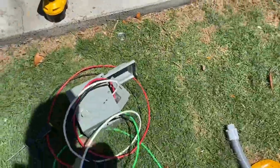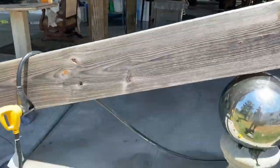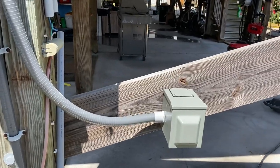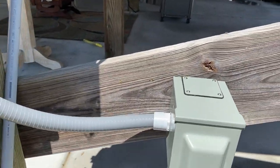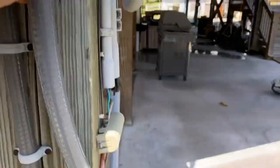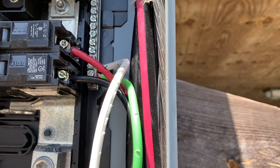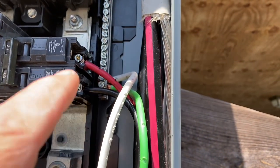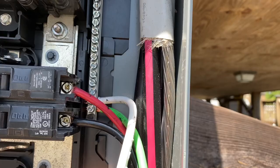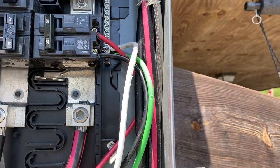Okay, does that make sense? I'm going to put it right here. I've got about five feet of wire. Now this is more to my liking. I've got my box kind of temporarily mounted here — need some straps for this, PVC cement in the joints. You see what's going on up here? I did one leg, both of those legs, to either side of that 50-amp breaker. And I've got my common and my ground coming into that neutral bar there, which should do the trick.